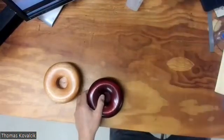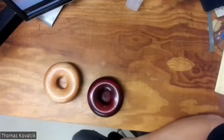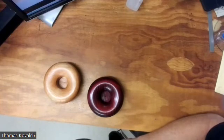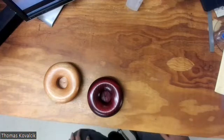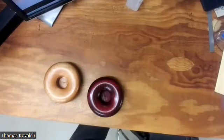The next thing is finish. That's what I use for finish. I like to use a simple finish. It's just oil and wax. I've been using Bush oil pretty much since I moved here. It's got a lot of solids in it. It builds quick. It's easy to repair if you have to, and it gives a nice shine and it lasts a long time. If you guys are making stuff to go in a store, sometimes they're going to be sitting there for a while. And as you know, if you use a mineral oil or even a walnut oil that doesn't have much consistency, in about a month, it's going to fade out, right?